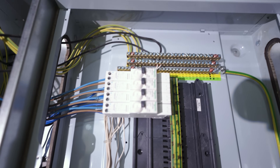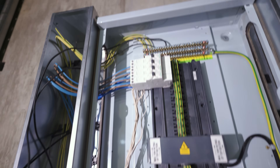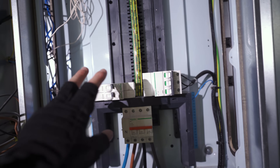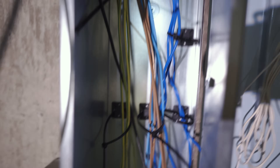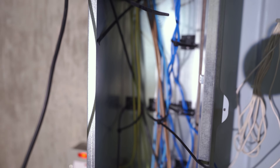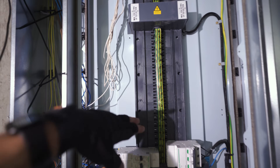That's the inside of the board. Gary's already put some circuits away up here, got some temps on - leads are just sort of put away for now. We're going for nice and neat like that, everything just sweeping in. These are just the site temps so they can do whatever. This is for the metering - I'll bump these up and put a breaker here for the SPD which will get mounted in the trunking below. I'm just going to have three rows keeping everything nice and neat. I'll start on the right hand side - still waiting on some breakers for the left. He's stripped all the armoured for me as well.